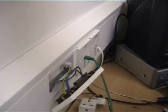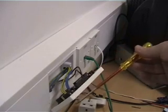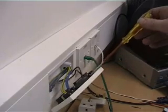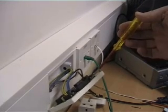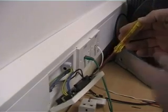We're going to try to check if there's voltage, just using an ordinary phase tester. It's probably a quick way of doing it, maybe not the most reliable, but it's a simple case of touching it onto the live terminal, putting your thumb on the end. I don't know if you can see it in the video, but there should be a small glow of light appear in there. It's maybe not very clear on the video, but that's just a quick indicator.